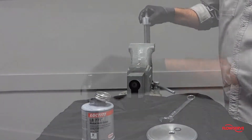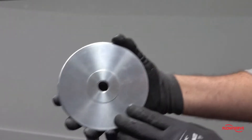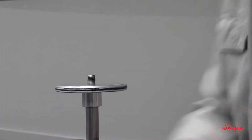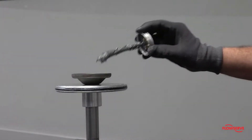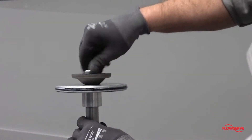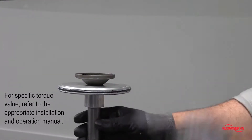For fail open configuration, install the spacer, then install a new stem o-ring. Install the piston with the counter bore facing down. Install the spring button with the dished side facing up. Apply anti-seize compound to the threads of the stem and install the lock nut. Tighten sufficiently so that the piston cannot spin.